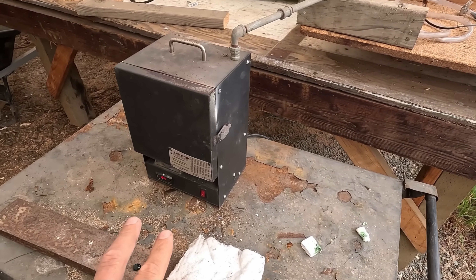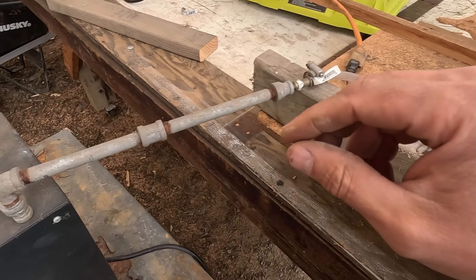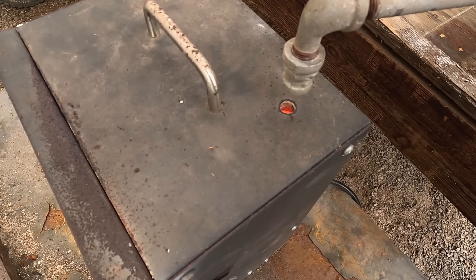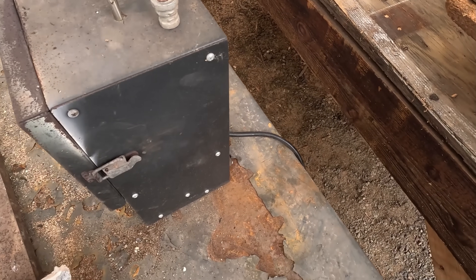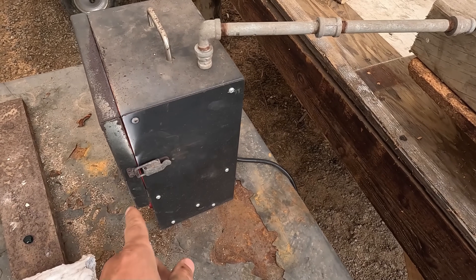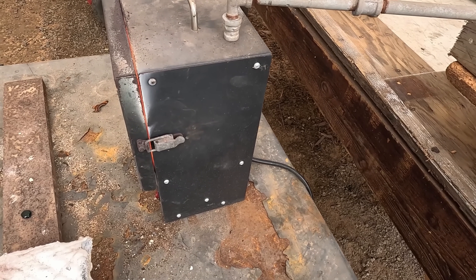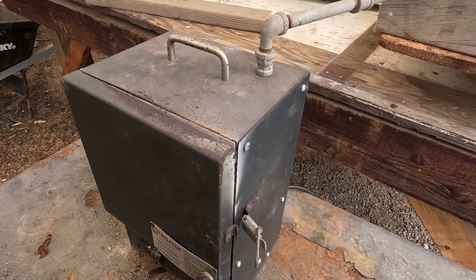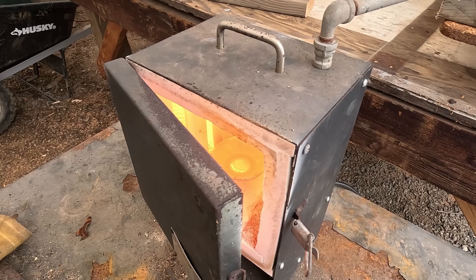Alright, we're going to try this system. The furnace is back up to 2,000 and we're molten in there. I've got my little aquarium pump set up. There's a little vent hole right in the top of this furnace, and I'm thinking if I just put the aquarium pump there, we can pump air into the chamber and have some air movement — because right now when it's all closed up, I think it's pretty much a vacuum. Oh yeah, there's a little bubble floating around on there. So it's working.